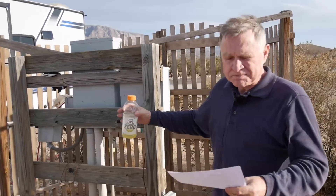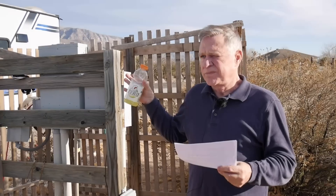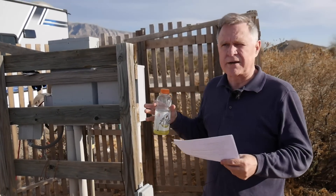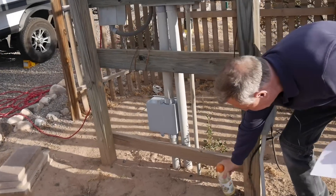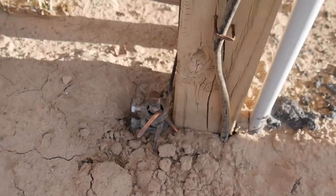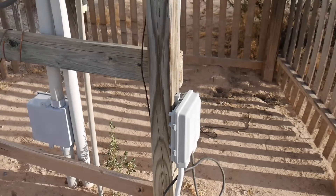Now that I was able to measure it, it got a lot more fun. I got to measure to see where I was at, got to add ground rods, and watched the improvement. We're standing at the electrical service entry panel. You can see the circuit breaker panel here, where the wire from the transformer comes in from the street. What's unique about this is I have three electrical circuit breaker panels — the entry, one for the home, and one for the shack. When I moved in, we had one ground rod right there, and I measured the ground resistance at about 25 ohms. I felt that wasn't low enough and wanted to improve on that.